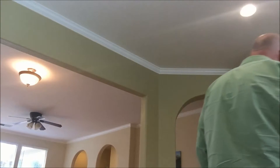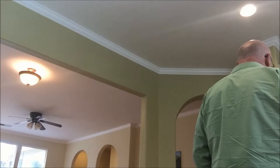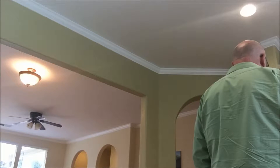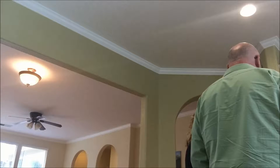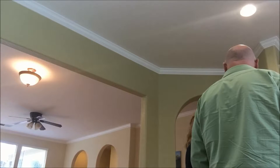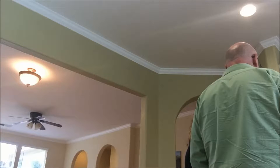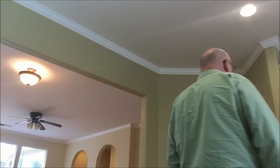It almost looks like we had a little issue with microwave radiation not quite 100% staying inside. Normally you don't get all this scratching, all this rust, and the paint coming off unless there's leakage right there at the door. Somehow we've got a little bit of leakage on this door — it's not venting, which is causing condensation inside the door. Any scenario here could be the answer. Other than that it does work. But it may start sparking a little bit.